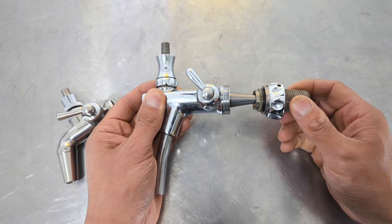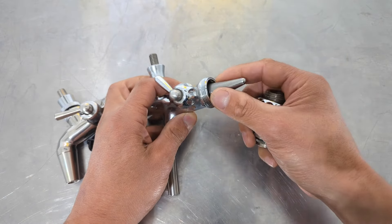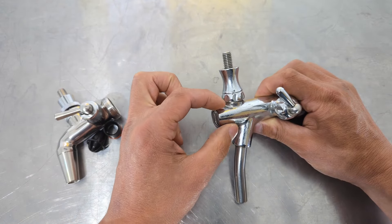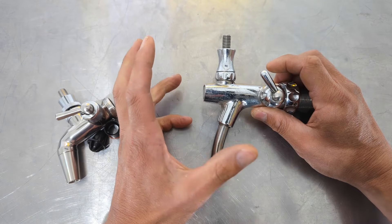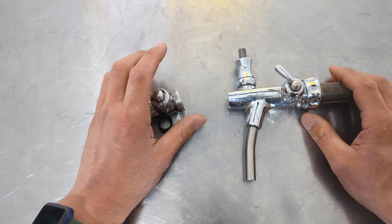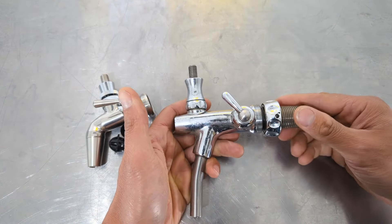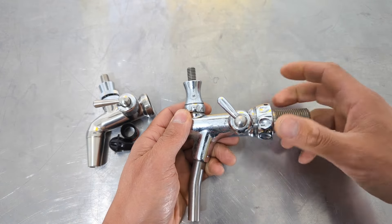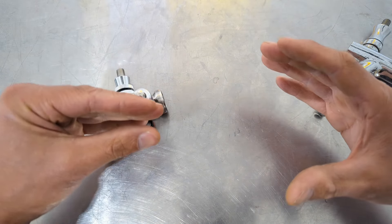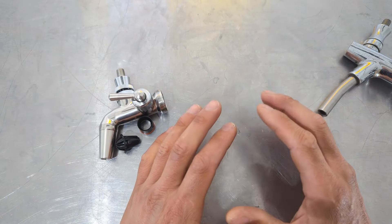Here's a Chelly tap. You can see a female cone in there and the male part on the tap goes together like that. I wouldn't go with this older style tap because these are rear sealing taps, which are generally not as sanitary as a forward sealing tap. Micromatic have got some of their own designs, but essentially there are no new innovations in these flow control mechanisms — they're all just two male and female cones coming together. There's a better way to do it, and I'm going to show you in the CAD.